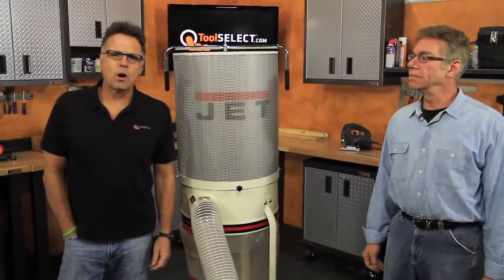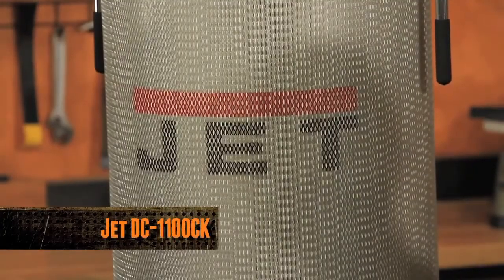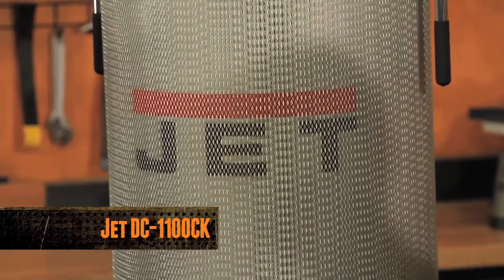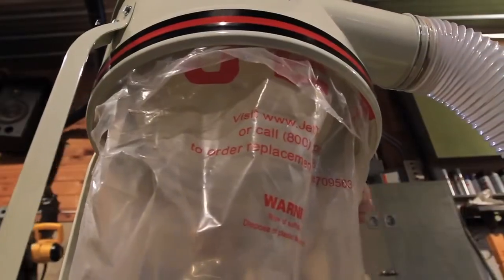Hey, what's happening? Barnaby here. So you want to know more about the JET dust collection system? Well, it's got a 1.5 horsepower motor creating 1100 CFM of suction, and as far as particle containment, 86% of 1 micron, 98% of 2 microns.